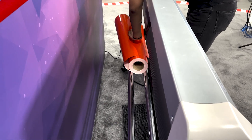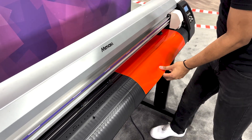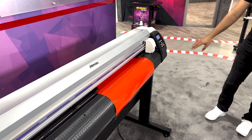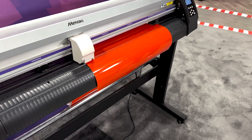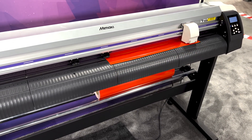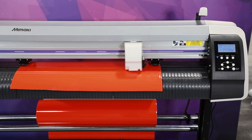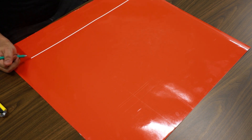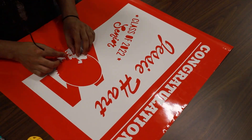Before we send the file to plot, let's load the roll of vinyl on our CGSR3. Place the roll on the back and feed the vinyl through the pinch rollers. Make sure the pinch roller is on the edge of the material — here we will only need two. Once loaded, press Roll or the left arrow so the plotter can read the width of the material. Once we put the plotter in remote, we can now send our cut file. The cutting process will vary depending on the intricacy of your design. Now that our cutting is complete, let's start the weeding process. I am using the weeding tool to remove the vinyl that I don't want transferred to the foam core. It is very important to make sure your plotter cut the vinyl completely and did not pass through the liner on the back side.